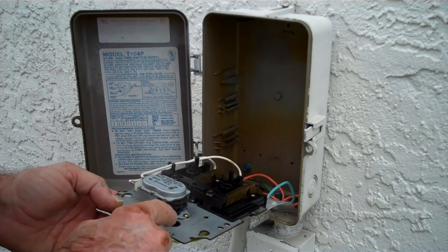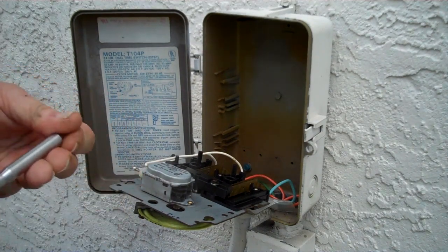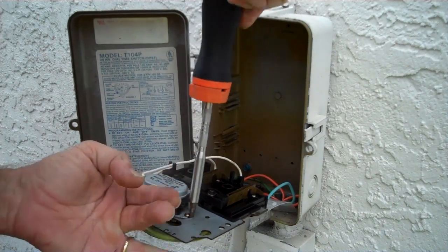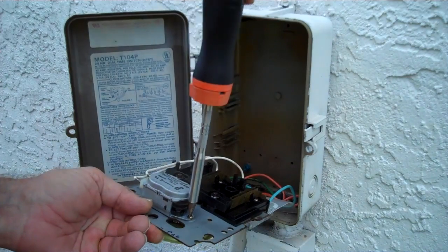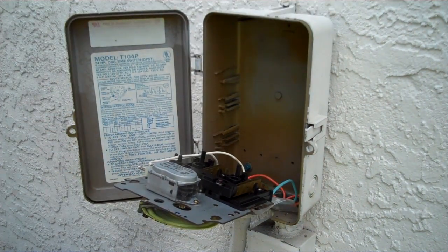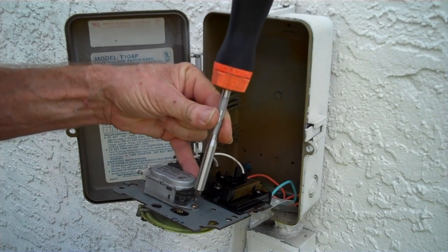And of course the motor has a flathead or a Torx. We did happen to bring out our flathead, so we're going to take our flathead and remove the two screws here on each side. We have our magnetic screwdriver. And I found that our flathead doesn't fit this screw well. So we're going to go get our Torx. Okay, we are back. And we found that this is a T15 screw, or Torx screw. And we're going to remove these.